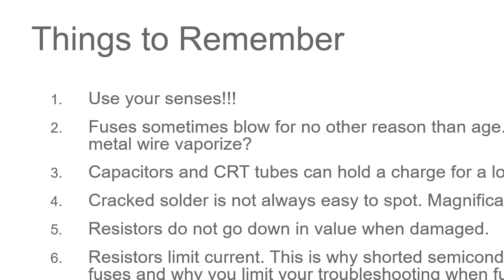I had a 20 megahertz oscilloscope. I bought 13 oscilloscopes from an auction lot, tested all of them out, fixed all but one, and sold them all. The last one was a bit of a pain in the butt, but I finally tracked it down to a leaky diode in the focus assembly that was causing the screen to bloom super bright and be way out of focus. The diode went leaky, so it conducted easily forward, but was partially conducting backwards when it shouldn't. It's rare, but it can always happen.